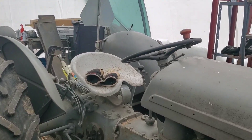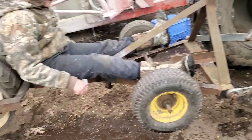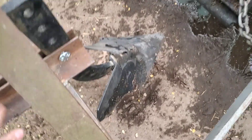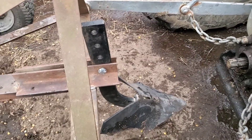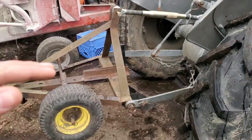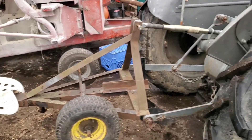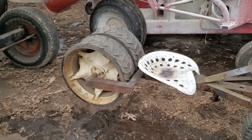Now I'll hook it to the tractor and see what that looks like. Alright everybody, I got it hooked to the tractor here. Brock's sitting on her. As you can see, the ripper or furrow opener is right there. I have to take the drawbar out to be able to use this. I'm going to have to figure out our depth when we get in the field. We might need a longer three-point arm to tip it back more, but that can be figured out when we get to the field. This should work — that's how I built it.